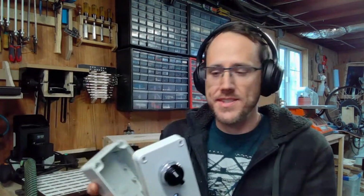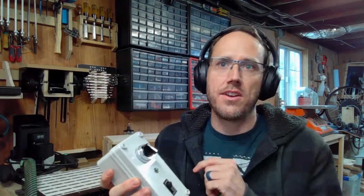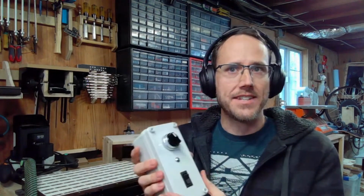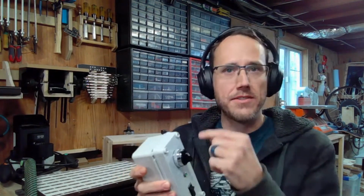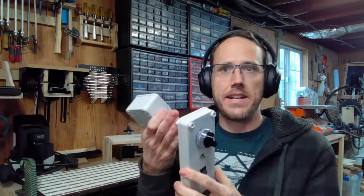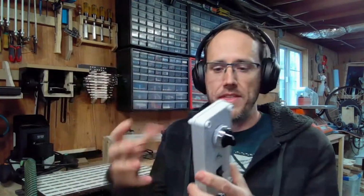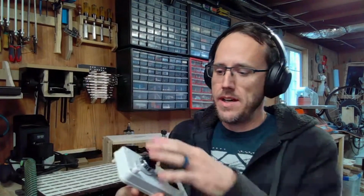All these things that mount to panels, they either have a bolt pattern or they have a circle with keying in it, or a rectangular shape. These things need to basically have CNC or other prototyping methods to prove the concept and try it out. And so this box here, we have a round cutout with a key, a circle, and a switch. And so as a mechanical engineer by background, I would go to SolidWorks and download solid models and throw them into a 3D model of everything in assembly. And then I would get the outlines that need to be cut onto that face.